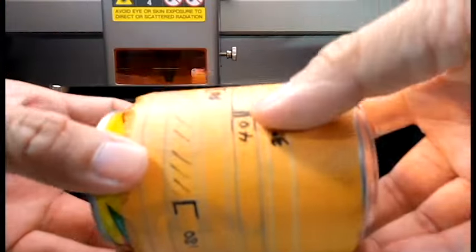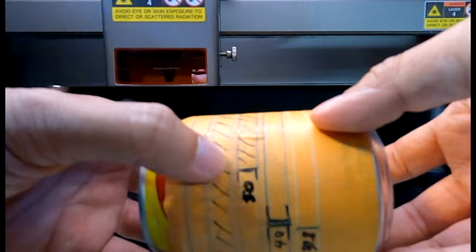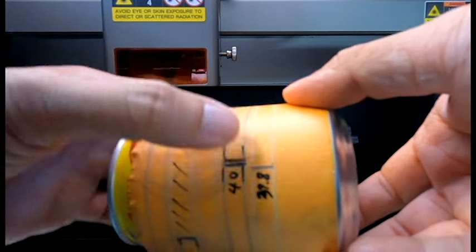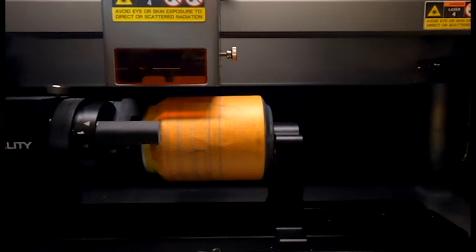Initially I start with the default number, engrave once, and observe. If the rotary rotates too many times before completing the calibration box, the number is too high — so you keep lowering it until the engraving matches from beginning to end and the lines meet. You just keep adjusting the step value in the rotary setup, increasing or decreasing it. For me personally, I did it four or five times, and then you set it once and you're done.